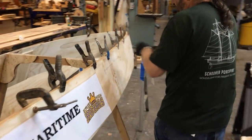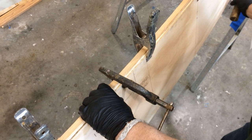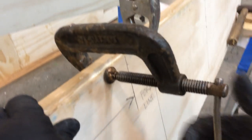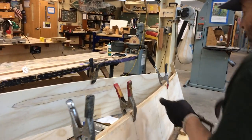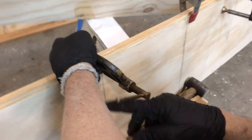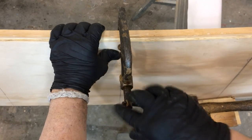Good — we had enough glue on there. Tighten this up a little bit. Might go down just a touch here. Tighten this up — plenty of squeeze out. We'll wipe all that up with damp rags, as much as we can get that off today. You might notice that I already had these clamps set pretty much to the distance that I needed — they were open a little bit too much, so I didn't have to spend too much time right now getting these properly in place.